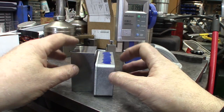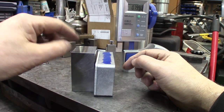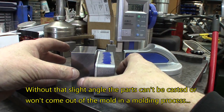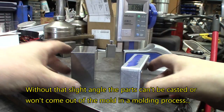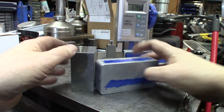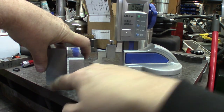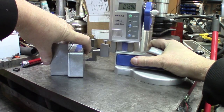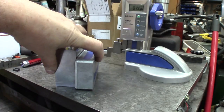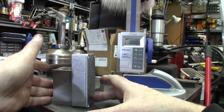Before we start making measurements on this, take note that when you get a casting or a molding, be sure to take into account that the walls aren't perpendicular — the sidewall is not perpendicular with the other surfaces. This would impair the removing of the mold. In order to make my lines properly, I'll be holding this against a right angle block. It's going to make my lines precisely at the right place. Now I'd like to get the height of that box — because these sides are all a little bit angled.